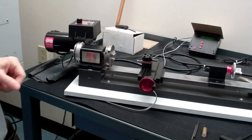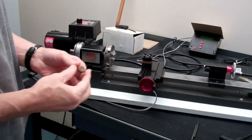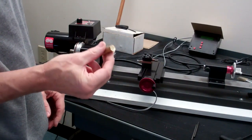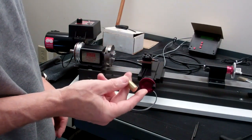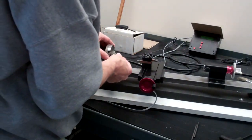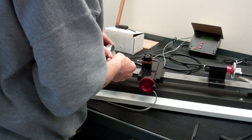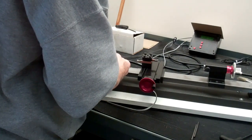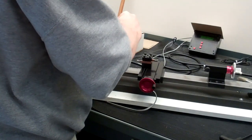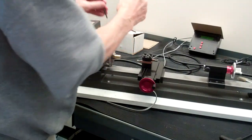Let's do a demonstration of several operations on the lathe. I'm going to demonstrate with a small piece of brass — this is a half-inch diameter brass rod, the perfect shape for the three-jaw chuck. I'll just load that up in the three-jaw chuck like this. You do want the chuck tight so the part doesn't come loose while you're turning, so we'll tighten that down.